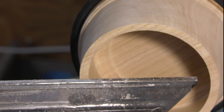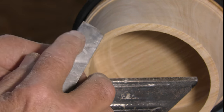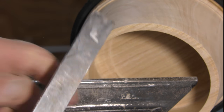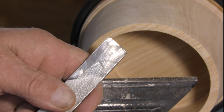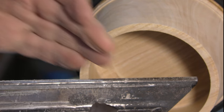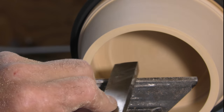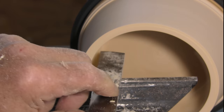Now, coming into the corner here, this gouge just needs to be skewed slightly more. So in this situation, it's already about 89 degrees up in the corner and just a slight curve. It's going to have a bit more of a curve. So all I've done is just swung the handle round, so that's slightly more radius and angled, skewed, so I can get into the corner with the tool, and see where I am. And again, I'm watching what's happening over down at about 5 o'clock.